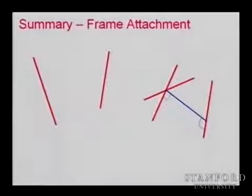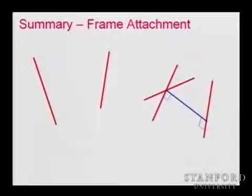We're almost there. So today I'm going to cover a few examples. I know this might be a boring topic, but we really need to understand how we can do frame assignment, because this is the only way you can generate the forward kinematics. And what we're going to see is that once we have the DH parameters, essentially we will have the forward kinematics, which means we know the position and orientation.